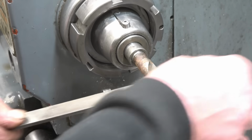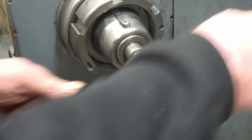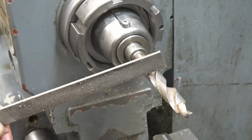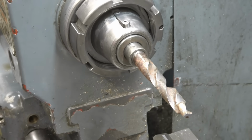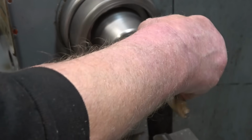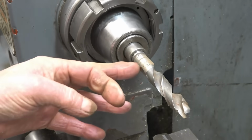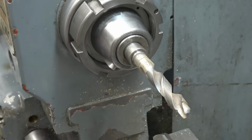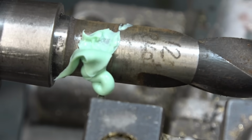The drill is obviously hard here, but when you get to that bit, it's soft. So it's soft there, that's hard there. So it is really good material. You can harden and temper that as well. Right, part it off across there now. It's a bit generous, John.